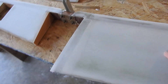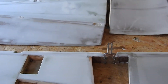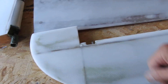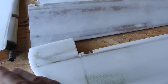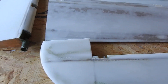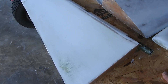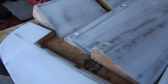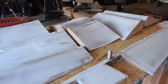I'll do this probably in two coats — one side, all of them at the same time on one day. You put one coat on, squeegee it off, and then you wait about 30 minutes. If it's starting to feel tacky, go ahead and do the second coat. I figured it'll probably take two, at most three coats, to get it filled in. So you're talking three coats with half an hour between each coat — it takes several hours, and then the rest of the day for these things to cure enough to flip them over and do the other sides. It's probably going to be a two-day process.